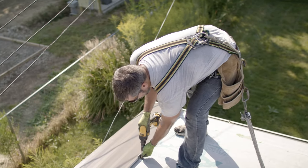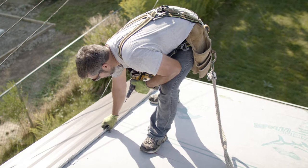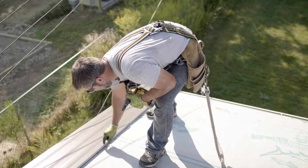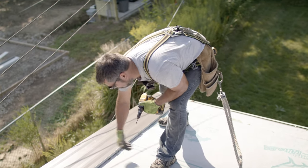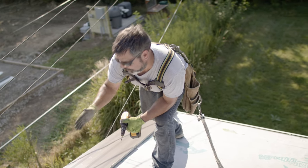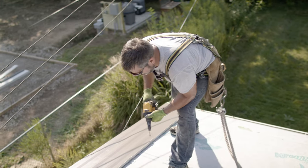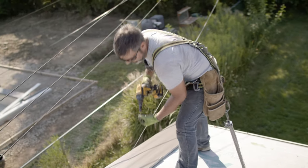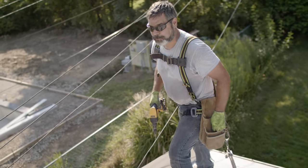We want to make sure as we put these clips in, we don't have a clip out here and then a clip pushed in. These ones actually hug the panel pretty tight, but you can get gaps in them. And if you do that, you'll be throwing oil canning into sheets. On a longer sheet, you can actually look up the sheet, and if one guy's putting clips in, the sheet will actually be bowing ahead because they're forcing a gap in between every sheet. So if you get them too tight, you can force oil canning. If you make them too loose, you'll actually bow the sheet.